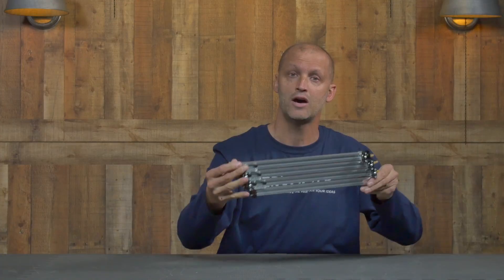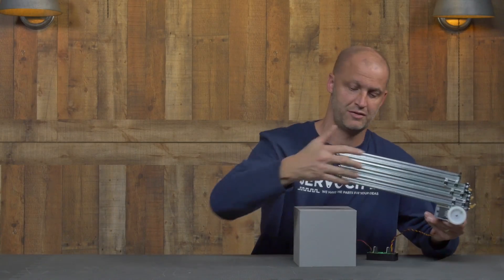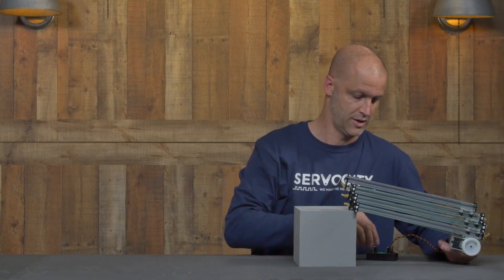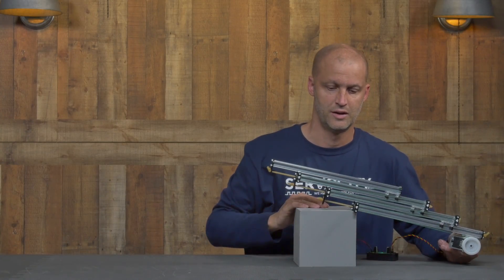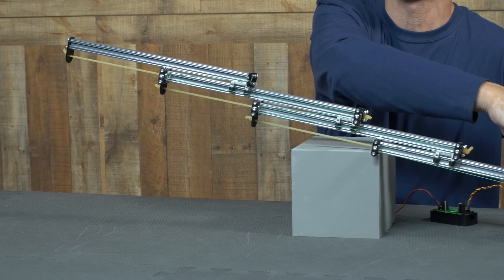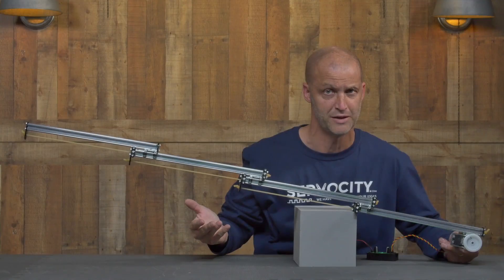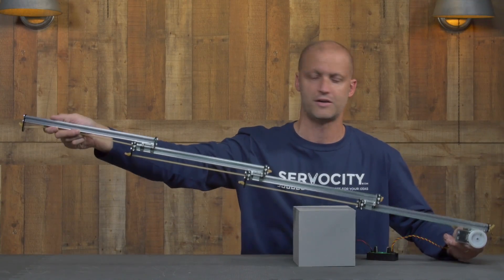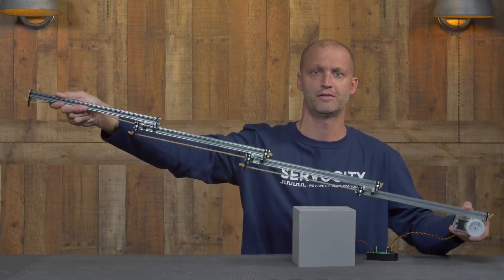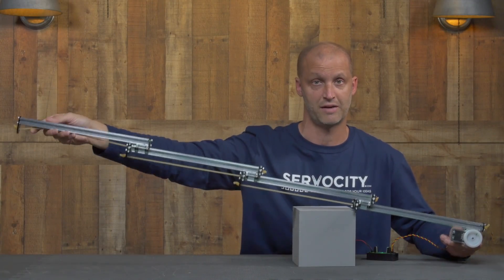Now let me show you what it can do with various motors attached. We've got the slide kit connected to a 785 servo, and let's run it out for you. As you can see, it's very smooth. We have it connected to a 785 servo, which we absolutely love because you can get it to run up to seven rotations depending on your PWM signal that you're sending it. As you can see, I'll grab it here — very stiff, no slop — and it can handle a good amount of load on the end without any kind of flex.